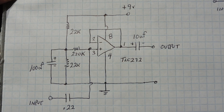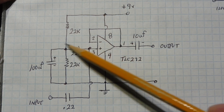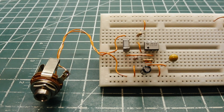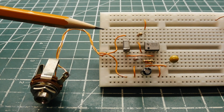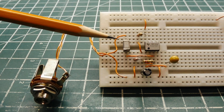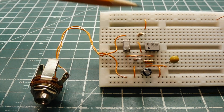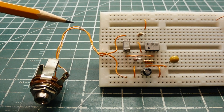So you figure out the output impedance of your device, multiply it by 10, take that resistance value and put it in here — that gives you your input resistance for this buffer amplifier. The guitar jack is plugged into the unity gain voltage follower circuit. The input capacitor is small at 0.22 microfarads because of the high input impedance — you can use electrolytic, or polypropylene or polystyrene for good quality. The output signal comes off a 10 microfarad capacitor. The signal coming out of here can be processed into further circuitry without worrying about loading down the input signal from the guitar.